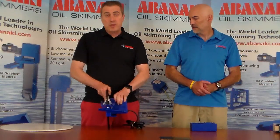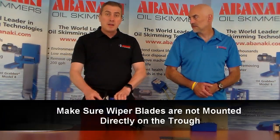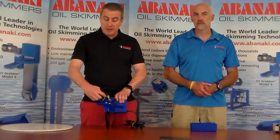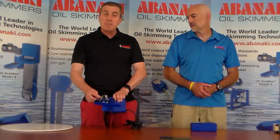The other thing to consider is the way we mount these blades. These blades are not mounted right up against the troughs. Instead, there's a standoff. These things sit about an eighth inch off the trough, and that allows oil that might get behind the blade to travel back down. Rather than landing on the outside of the trough, it makes it into the inside and down to your container.